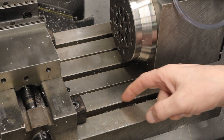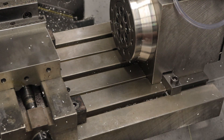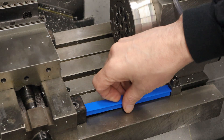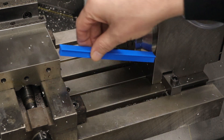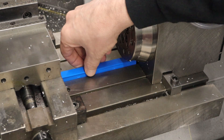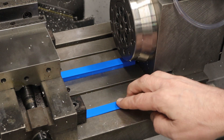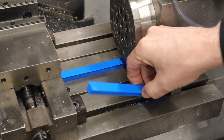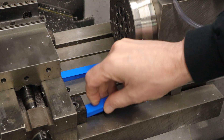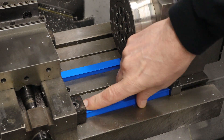One of the things that keeps bugging me is the chips build up in the T-slots, and blowing them out is always a pain. So one of the things that I did recently is I created these 3D printed inserts that go into the T-slots, and I created two different sizes. These push down in — this one is pretty tightly fitted.